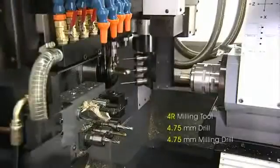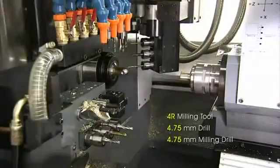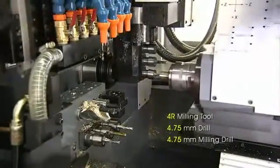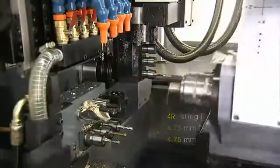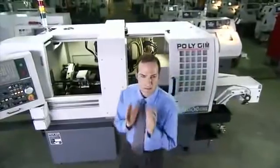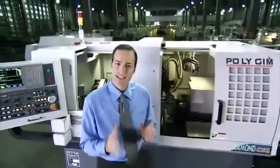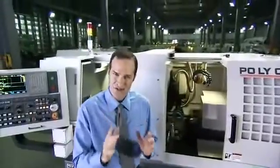But the truly groundbreaking feature of the CSL Series is its optional, internationally patented, fully automatic B-axis capabilities. For B-axis machining, most other Swiss-type lathes only come with a manual option, which takes time to adjust, lacks precision, and can only machine at one angle during the work cycle.